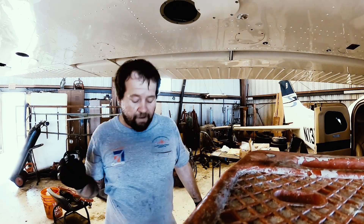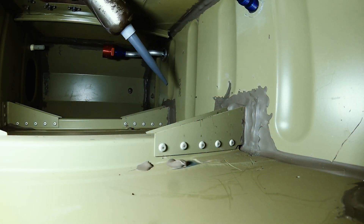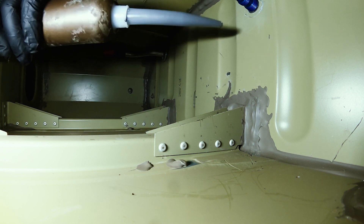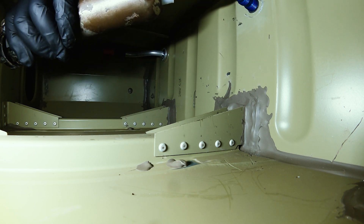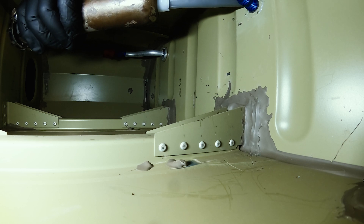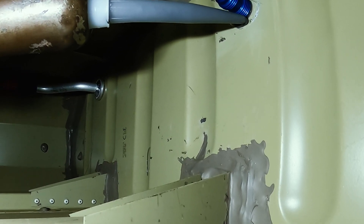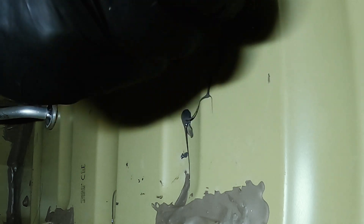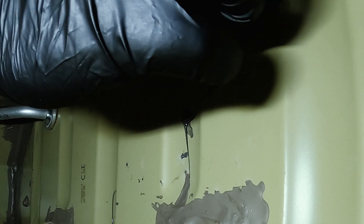Anthony is taking the pneumatic press and squeezing out the Flame Master chem sealant, sticking it out on the end of the washer and squishing it in there so it splooges around. Not a lot of room — the tubes are quite large; I think they'd make kind of a half-size length tube for this. He squeezes it to apply the Flame Master chem sealant. You can't always get around everywhere you want, so his trick is to get as much as you can, apply the washer, rotate it around — that should spread enough on both sides — then put on the top nut.